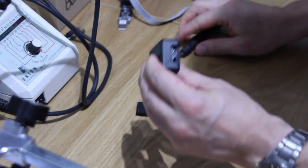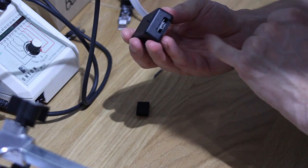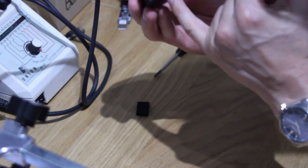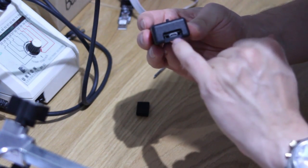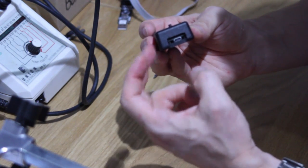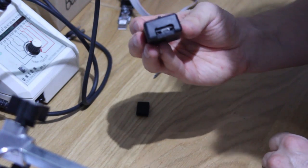And there we go. Now, make sure obviously you've got enough clearance for your connector, for your USB lead, but the USB plug itself should be butted up against the bottom lid, and that's very useful because that then secures this. It sandwiches it between the circuit board and the box and holds that connector a little bit tighter, less prone to break off.